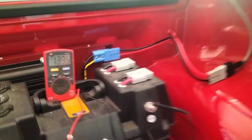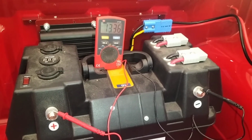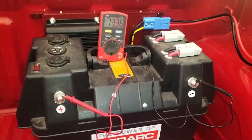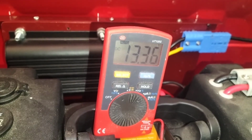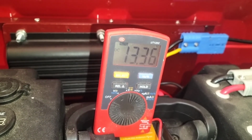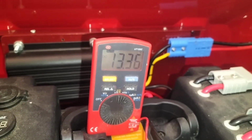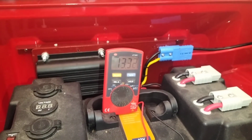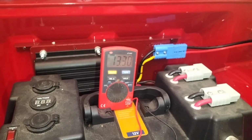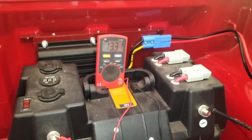And apparently when you turn the truck on, you charge by solar, so if you've got a rooftop panel, the solar takes priority over the engine. It says that in the Redarc manual. So yeah, this is pretty successful. Just in those few seconds it's raised a couple of decimal points. 13.36, so it's definitely working. That's just in a couple of minutes. Alright, so that's a pretty successful looking test, and have no doubt it'll keep the battery topped up. Well, I've got the engel running in a little Brass Monkey fridge and various other stuff during the daytime. So, successful test.